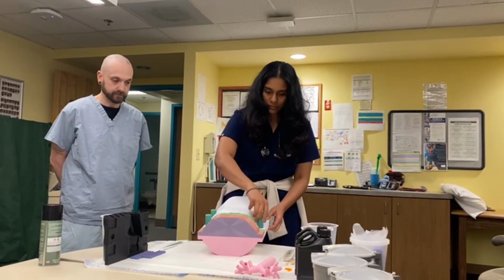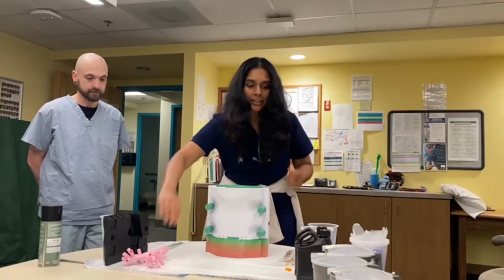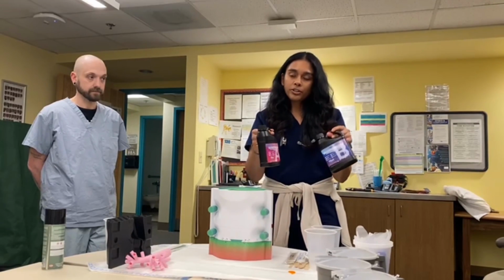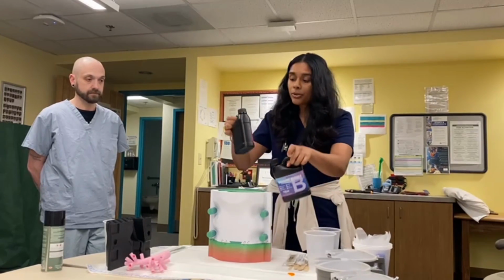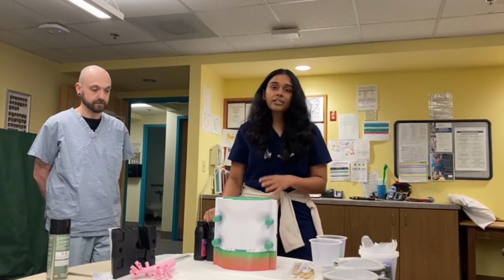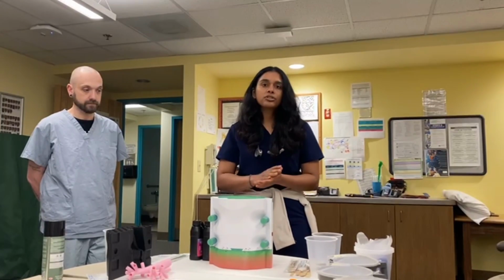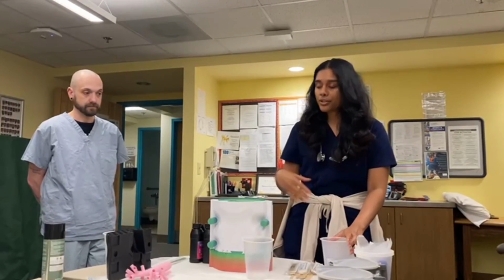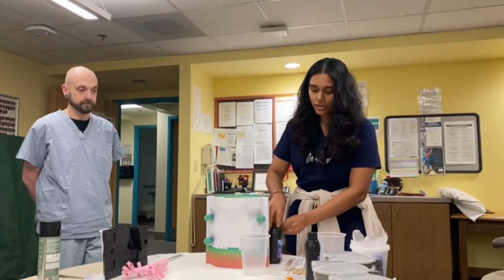We'll be setting the tracheal part aside, and the main mold here that we're creating is we're using silicone rubber. So that comes in two parts, a part A and a part B. They're to be mixed in an equal 1:1 ratio by weight. You can find a lot of different kinds of silicone rubber with different hardness. What we're using here today is a 15A. That's kind of in between where you're not going too soft where it's crumbly versus too hard where it becomes like a solid piece. So these need to be mixed in an equal 1:1 ratio by weight. We already have them portioned out in 19-ounce bottles, so we're just going to mix those two together.